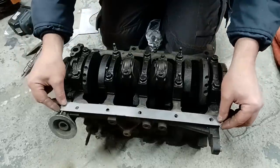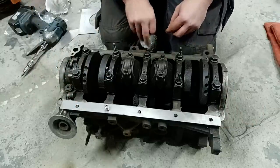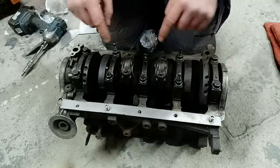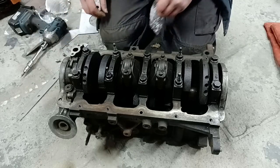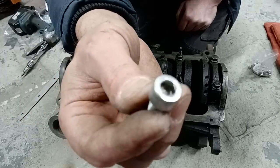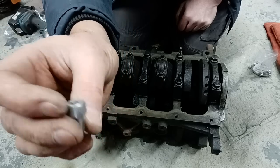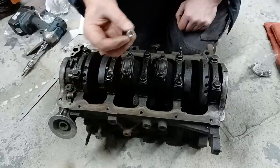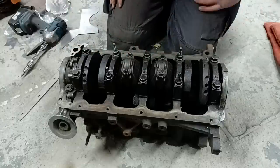All the way along there, I get a bolt in there, no problem. On this side, however, they don't match up. The only two that do are that one and that one. So be aware when you're doing this that the bolts for some are not the same either side. So keep track of which side you're doing. Now, the bolts I use for these are little cap heads, 8mm cap head by 12mm length. These are stainless. I ordered stainless by mistake. You don't have to use stainless, and it doesn't really matter with this application, but be aware stainless isn't as tough, or sometimes is a bit too brittle and they break. So don't use stainless for anything under serious load.